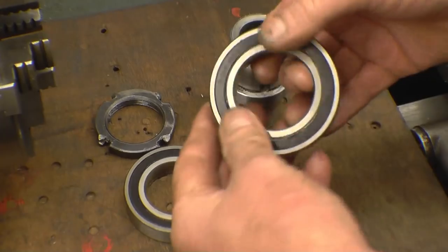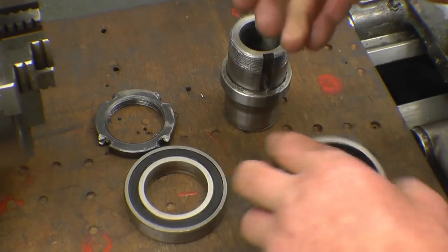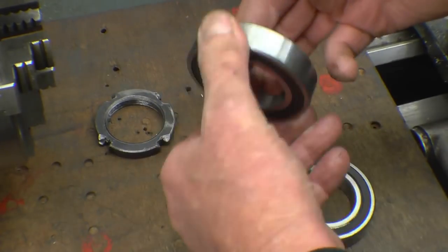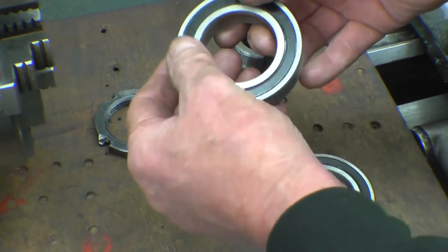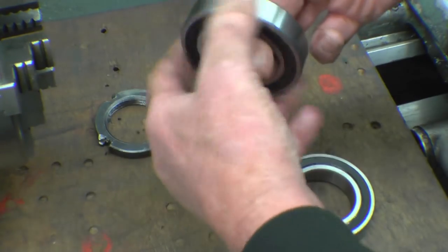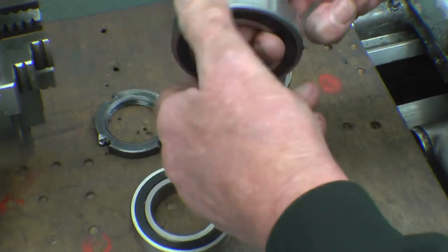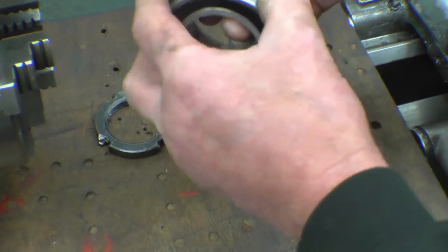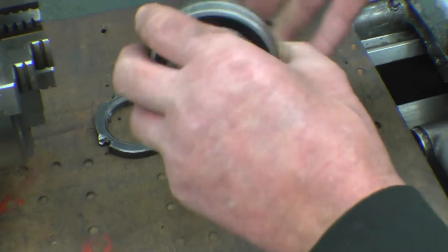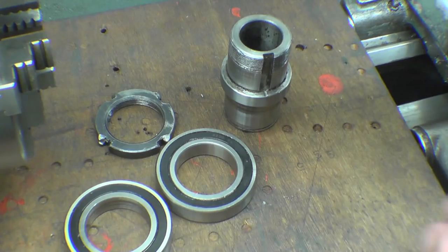These are the two bearings that we took out from the mill last week. There's absolutely nothing the matter with them. I pulled the rubber seal out, even the grease inside them is nice and clean. I repacked and re-greased them. I'm not going to replace them. I've had enough experience with bearings, there is no way those bearings are making that noise. I think it's all down to the pulley.